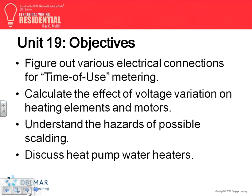Water heater, the same thing. If I have a water heater, am I going to be sizing how many gallons of water are going to be heated and so forth? None of my job. Somebody specified a water heater in one area. My job is to wire it, size the conductor, size the conduit, if any, and size the overcurrent protection device. And for a water heater, the controller is the disconnect. Did I forget the disconnect for these two? We have to have a disconnect.